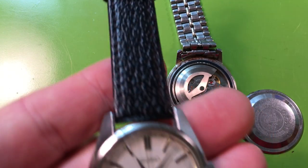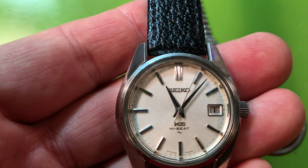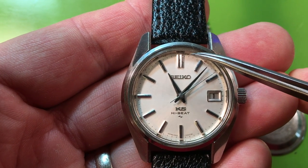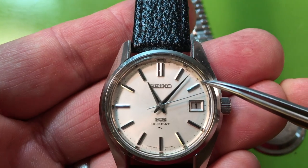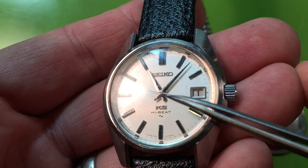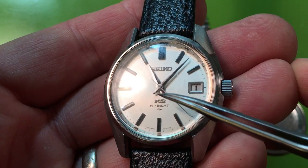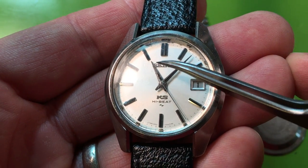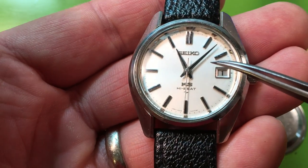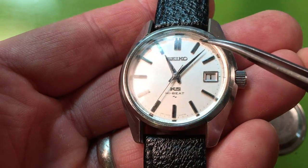Moisture sat in here, and this darkness — that's gonna be in between. That's patina on the metal underlayer. There isn't a thing I'm gonna be able to do with that. Your hand surface is a little damaged too. Somebody was in this watch — this kind of damage only happens when there's careless work done. I believe I have some new old stock handsets for this model. But this stuff, I think, is forever. I'd be amazed if that was improvable at all.